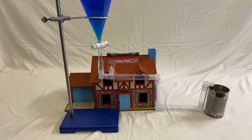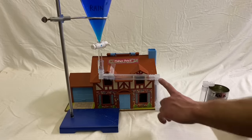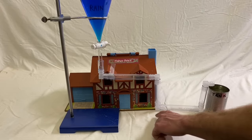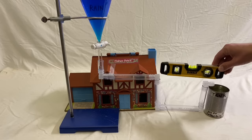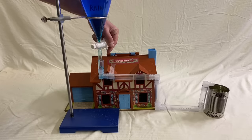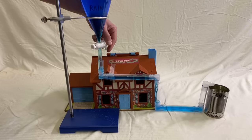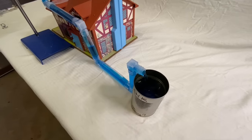For this to work, two big things have to happen. One, the PVC tube has to have watertight joints. And two, the vertical leg that flows into the tank has to be shorter than the vertical leg that comes down from the gutter. As long as the outlet that feeds into the tank is lower than the height of the inlet that comes from the gutter, the water is essentially flowing downhill into your tank and no additional pumps are needed. A height differential of at least 18 inches is advised to provide enough force to push the water into your tank. Let me show you how this looks in real life now.